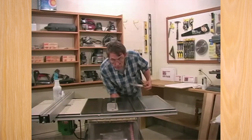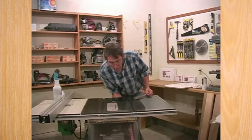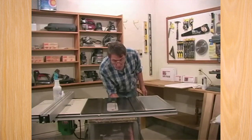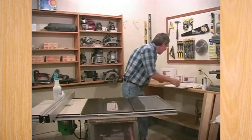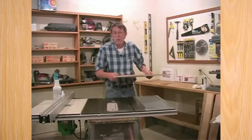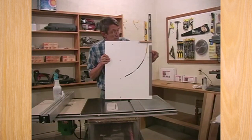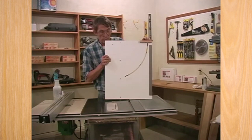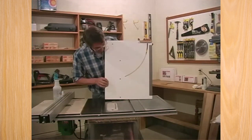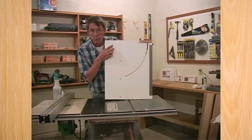Next, we're going to lower that blade and grab the W platform. The platform comes out of the box already assembled. You notice the scale's on. We call this wood block with the set screw the positive stop block — that's our micro adjuster, that's what the screw's used for. The arc's cut, the bar's mounted, and the pivot point's installed.